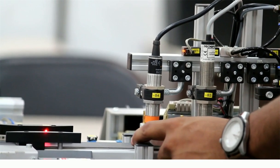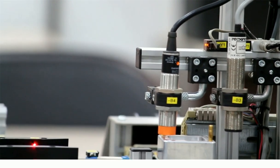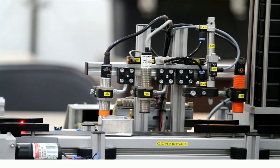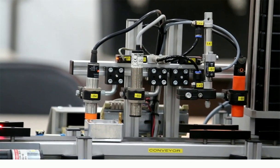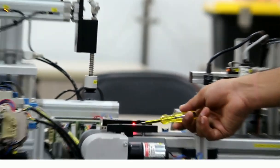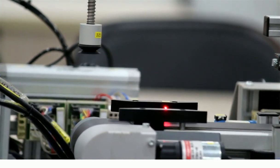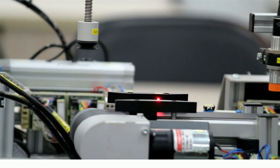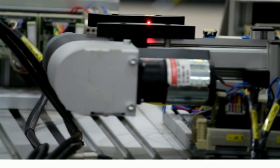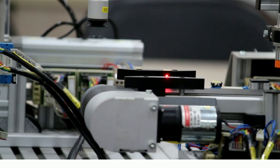If there is any metal-type material, this inductive sensor will send a signal to the PLC. All these sensors sense any object and send the signal to the PLC for the next execution cycle. There is also a light sensor — when there is an object at the conveyor end condition, that sensor sends the signal to the PLC. There is a DC motor with a gearbox system; this DC motor is responsible for running the conveyor system.